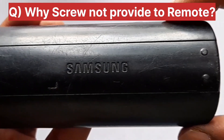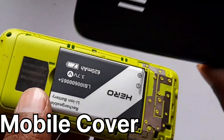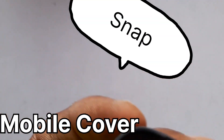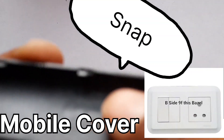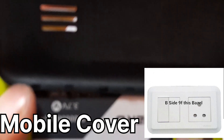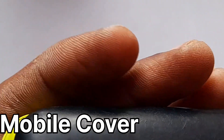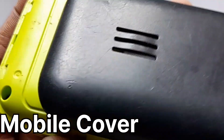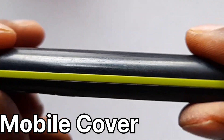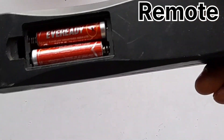My question to you: why is a screw or screw boss not given here — why is only a snap used? The next example is the mobile and mobile cover. The projections on the mobile cover act as snaps — similar projections are found on electric switch panels and wall-fitting electric boards. You just put the flap in and press it: the engaging angle passes and it fits directly.